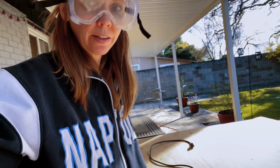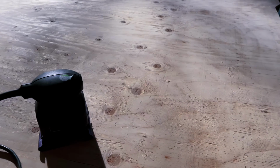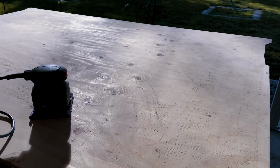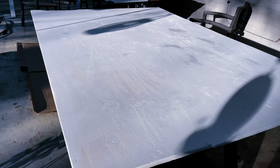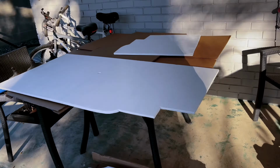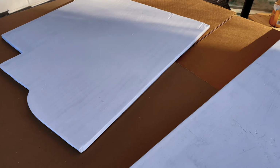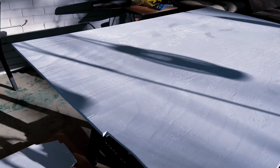And I just sanded the very last board of the floor. So now time for a paint with the mold resistant paint, even though it won't be seen because I'm putting actual floor on top. But that's next. This is my subfloor. I painted with a mold resistant additive. So this is my subfloor. Once it's dry, then we'll put it in.